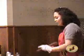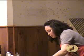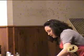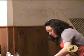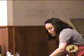Okay, so with the grain, what I'm doing here is I'm creating a slurry. Now the heat is what is allowing this oil to really penetrate. And this is really what's going to make your finish stand apart from just the standard spray finish. And again, the wood is only going to absorb what it needs, so I'm still going to have a little bit on the surface.